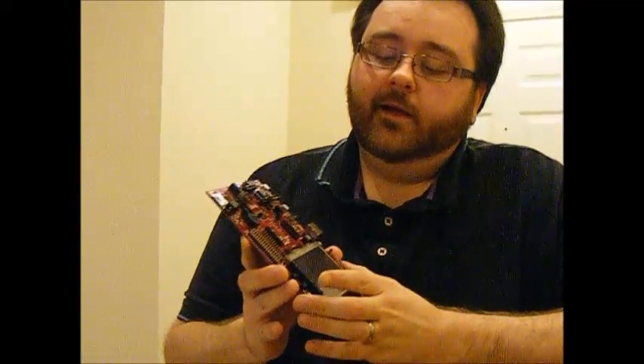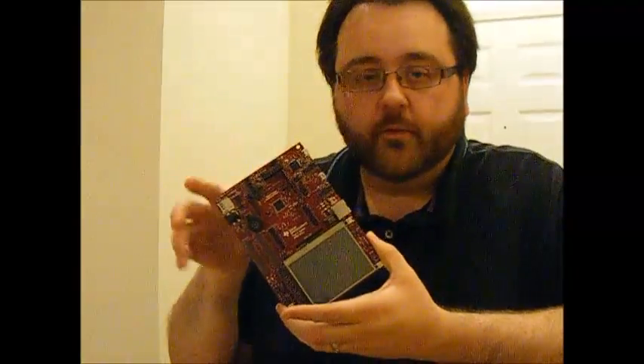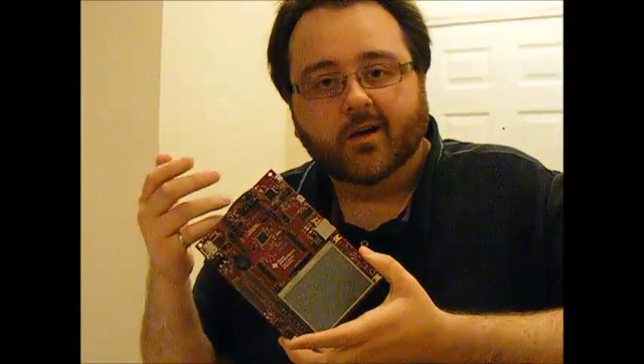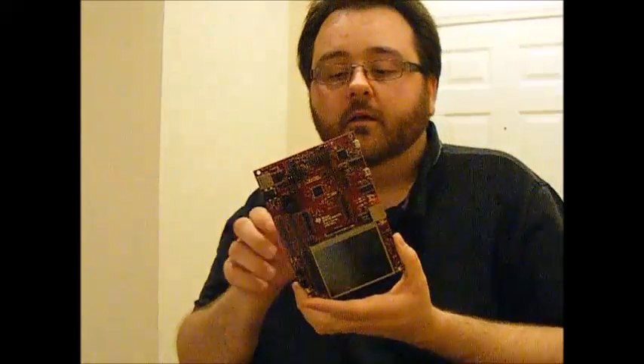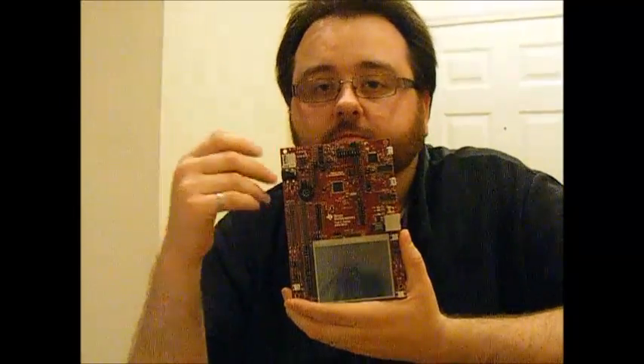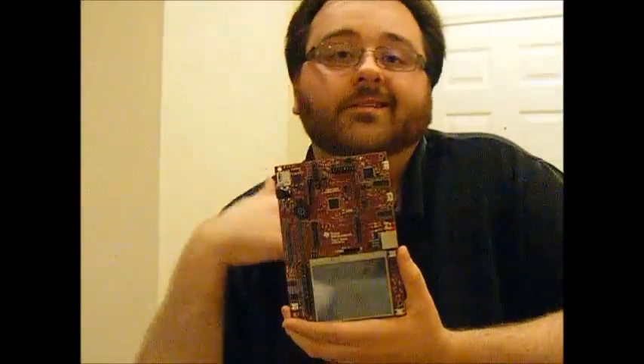For my original design, I decided let's do something easy and see how long it takes. So I said, let's count pulses — take an optical encoder on a motor, spin the motor around, count how many times it's spun, figure out its RPM. At about five hours in, including installation time for the software and all the libraries, I had the counter running. But it wasn't counting from a general purpose input/output pin or GPIO — it was counting from interrupt-driven counting.